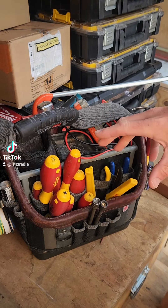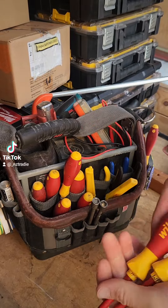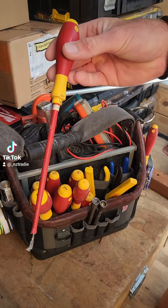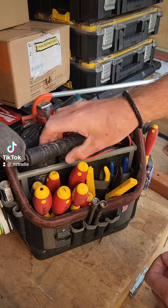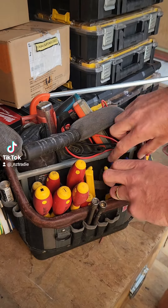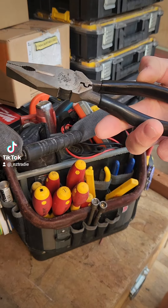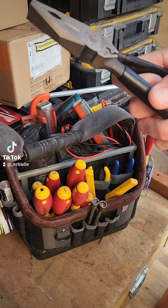On this side I keep my hand tools that I would have kept in a tool belt, because I don't particularly use a tool belt anymore. Standard everything — big and small square and flat blades and Posies all go in there, plus my extra long flat blade which I find really good for levering and getting further into the board. Pair of strippers, long nose, angled blue sideys, and Klein pliers. I've tried a couple of pliers but mainly stuck to these Klein pliers — I like the smaller handles on them. They're not 1000-volt rated but I try not to work live as much as I can anyway.